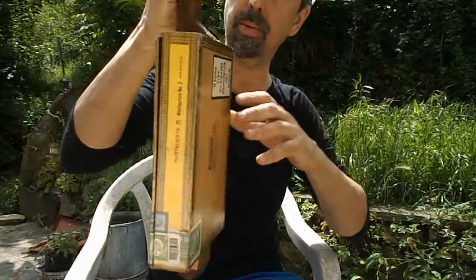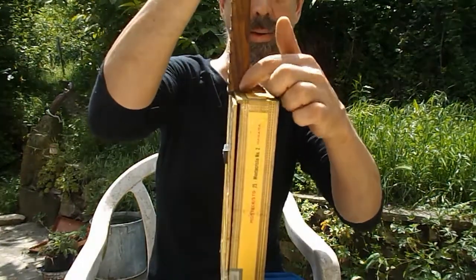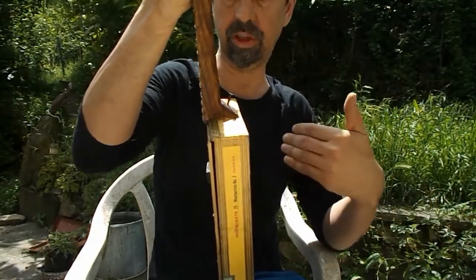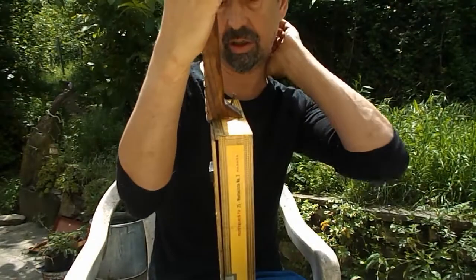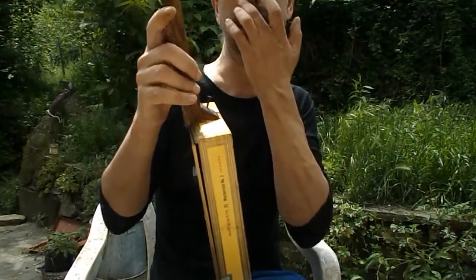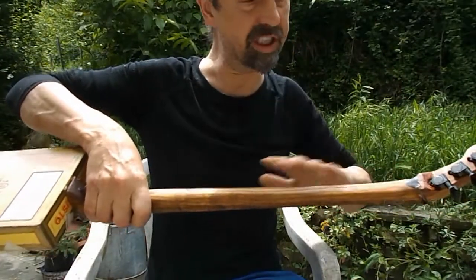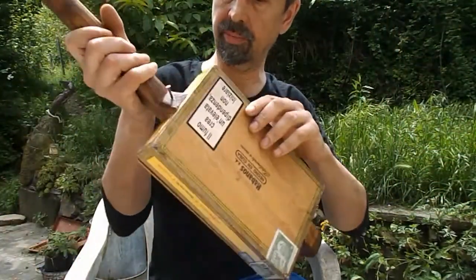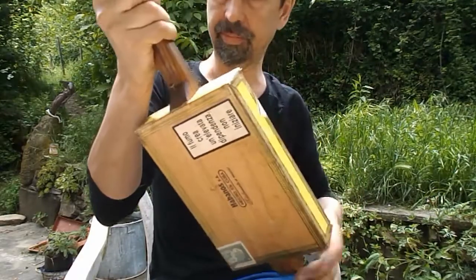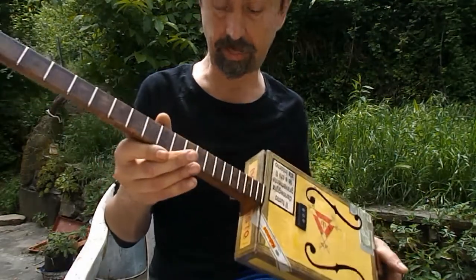But my first problem, I think it was when I was carving out the recess, I managed to snap it there. And that was down to the shearing of the wood. It's just so weak in that direction. But I continued, and because I'd already taken down the neck using a spoke shave and a bit of sanding, a bit of epoxy glue, and I've put a screw through, so that's relatively sturdy now. So that was my first mistake, which led to that problem.